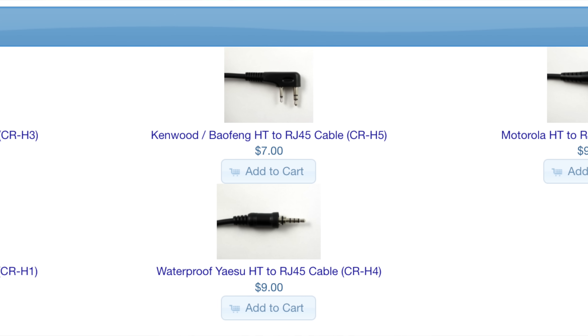For those that don't know, I'm going to explain what this means. I can plug this into a handheld radio using one or more of the accessory cables that you can buy, and it will, on whatever frequency it's set to, listen — when it hears something break squelch, it will record that thing and then play it back with like a second or two of delay. That's a rudimentary simplex repeater.